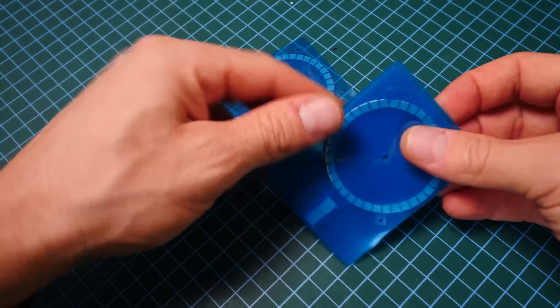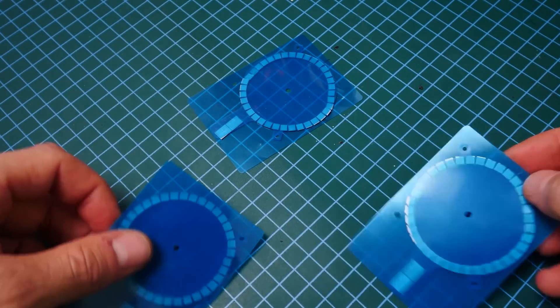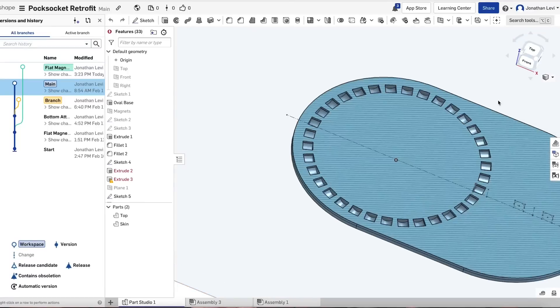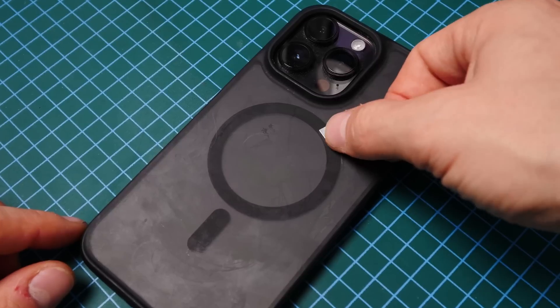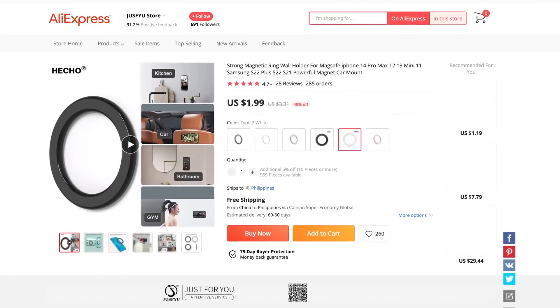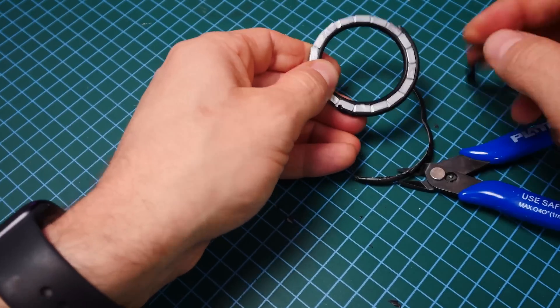When I tried to use those, the magnetism was not nearly strong enough to hold the phone, much less deal with the strains of pulling the phone out of my pocket at different angles. I tried stacking 3 or 4 sets to increase the magnetism, but to no avail. I even tried cylindrical magnets I had on hand, but the polarities weren't right and the phone still wasn't completely supported. It was back to the drawing board. It took me a while to find a product that would work properly, but I was able to find one on AliExpress which is actually designed for mounting your phone in different places using MagSafe - this product used neodymium magnets, and I decided to order a few sets to play around with.